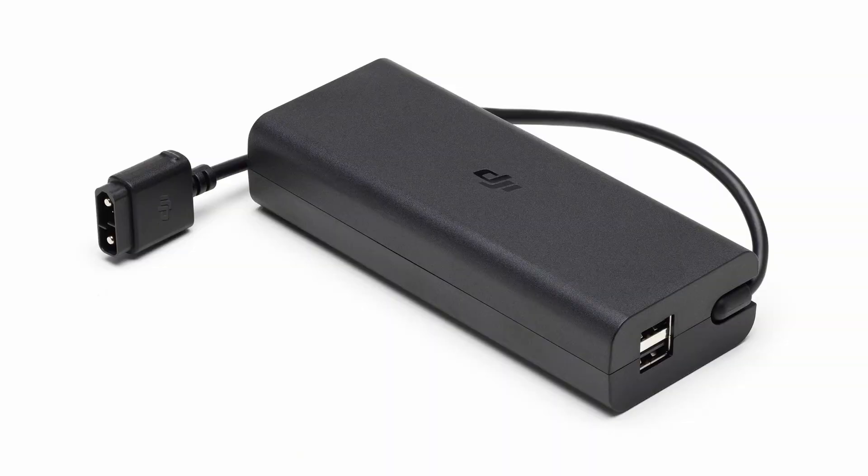The way this battery works is different to a traditional LiPo. Normally on a LiPo you have to charge it with a dedicated charger that carefully monitors the voltage and current, whereas the DJI battery is simply charged by a standard switch mode power supply. The charge circuit is actually built into the battery and all of the voltage, current, and cell balancing is handled internally.